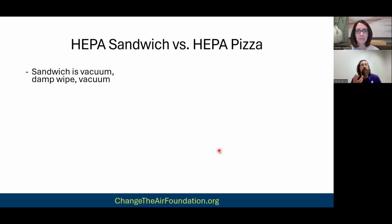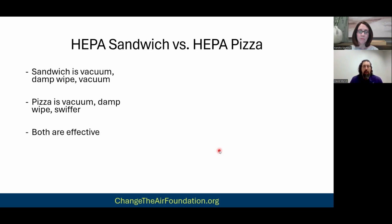Now I talk about this because this has come up in recent topics, right? Recently, HEPA sandwich versus HEPA pizza, and people are getting into this raging debate over which one, the pizza is the way to go, the sandwich is the old way. And to explain this for people who aren't aware, the HEPA sandwich is vacuum, damp wipe, vacuum. The HEPA pizza is vacuum, damp wipe, Swiffer. Both are effective. We've done both, right?